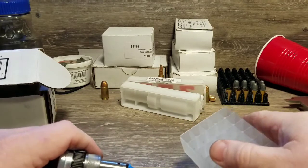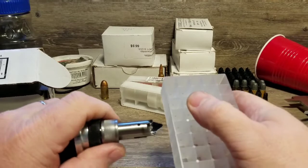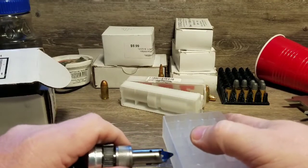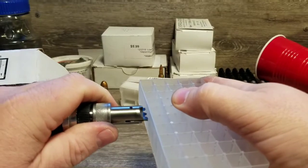I realized I'd lost the pin, did some hunting on the ground, and actually found it. Since that might happen to you all, I just want to show you: when you're pushing against the side of the workbench to free those blades, turn it like this so that the pin won't drop out from gravity.